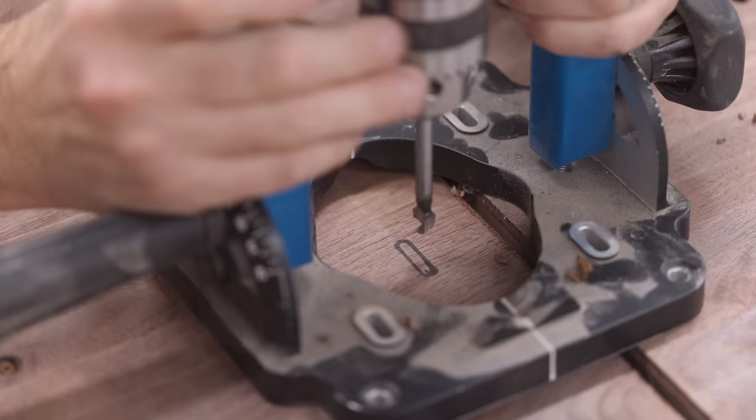This slab had several bark inclusions and cracks that needed cleaning up, including a large crack on the end. I'm going to secure this with bow tie inlays versus filling it with epoxy. I'm also going to add bow ties to fix cracks on the bottom of the piece — something several viewers mentioned on past projects. Normally I don't focus on the underside as much, but on this piece I wanted to level up my woodworking. To do these bow ties I'm using a bow tie template from a company called Slab Stitcher — not sponsored, I bought it with my own money — but they make really nice templates and my favorite part is they sell the bow ties to match. I do have to come back with a chisel to square up the corners where the router bit couldn't reach, but these bow ties came out really nice.